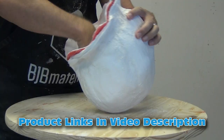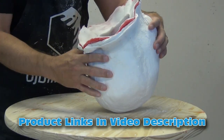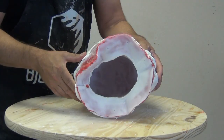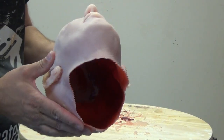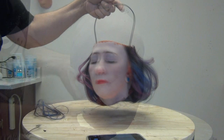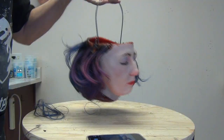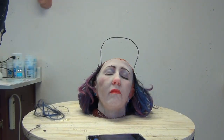The clay positive is largely unscathed with minimal cleanup — it will live to see another project — and now the silicone mold is nested in the mother mold, ready for casting. Stay tuned for part two, where I'll be making a slosh-cast hollow resin positive using TC821 translucent resin and finishing it out as a stylized but fairly realistic-looking tip bucket of Danny's head. Thanks for watching — check out the material links in the video description, and big thanks to Danny for asking for this cool little project.